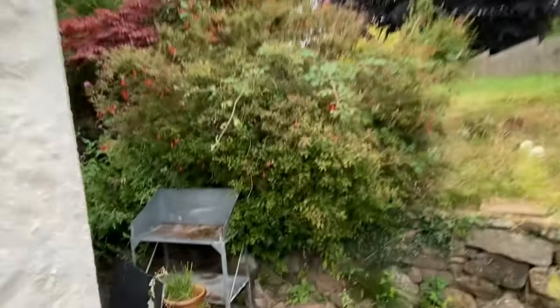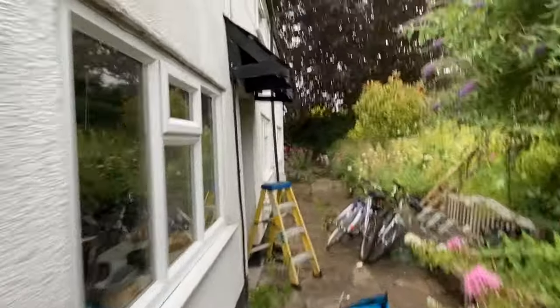We've got to go have a look at that big barn job I mentioned before — still haven't started that but I think it's an imminent start. I've got to pop up there for a meeting with the builders and clients. This one's done, didn't turn out too bad. Also, I had a bit of an issue — I was drilling from inside the consumer unit through a metre-thick stone wall, the drill bit was wandering, and I hit the live neutral on the RCD. It actually blew the main fuse, so we've had to get that sorted. It's been a bit of a nightmare towards the end, but we're done.